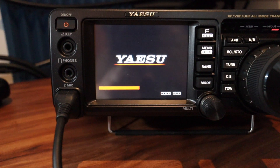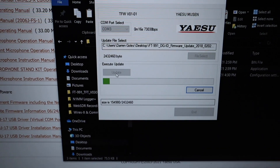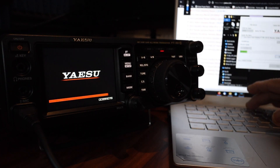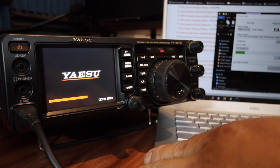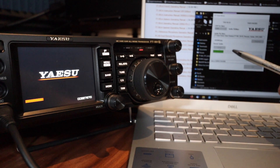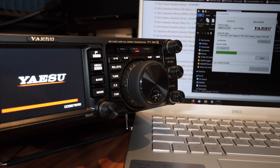I come over to the computer and start the TFT software. On COM 3, I select the bin file, click Open, then Update. The Yaesu display is now updating, and on my laptop screen you can see the progress bar moving. I'll dim my monitor so you can see both the radio updating and the progress screen.